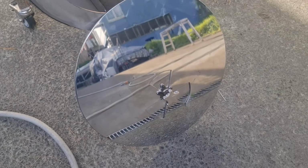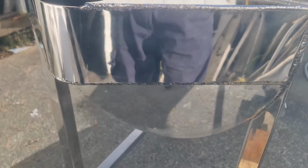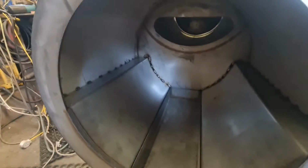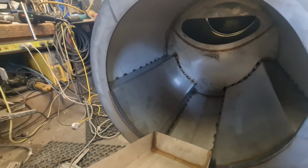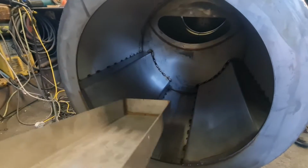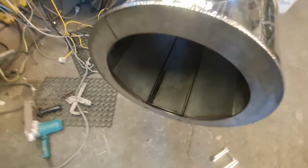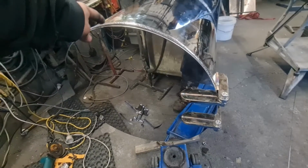The choke on the firebox door has spring tension holding it against the door for a good seal for better fire management. In the firebox, I've added an inner layer to help the ash and embers to collect in the ash tray. Made some heavy-duty hinges for the fire door and added a gasket.